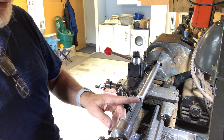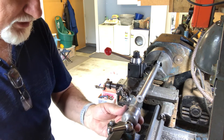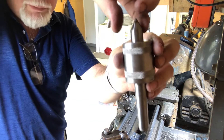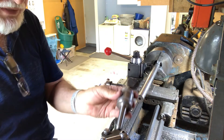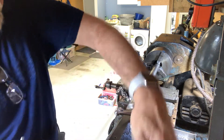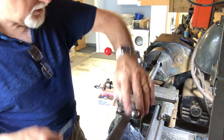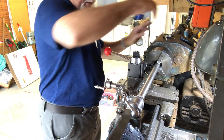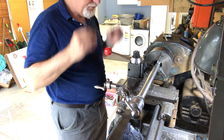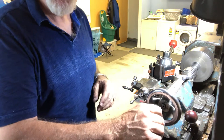I've got a center position here ready for placing this live center. This is a Chinese live center — I think it cost me about ten dollars, pretty amazing stuff you can get so cheaply from China. A live center means the center spins around; a dead center doesn't spin. That goes in the end on the tailstock. So clamp it down, tighten it up, lock it, tighten the chuck. I've got it running at 450 RPM — the chuck speed was an optical illusion making it look like it was spinning backwards.